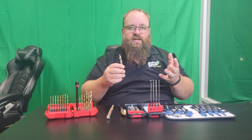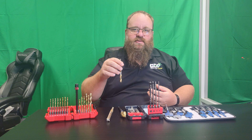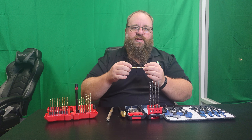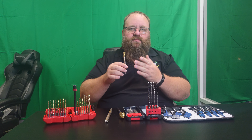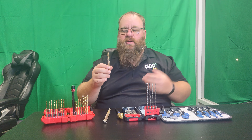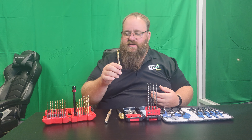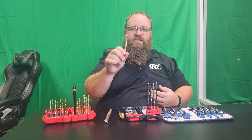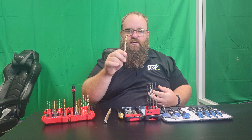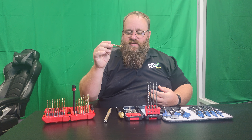I always recommend getting them in the quarter-inch shank so they don't spin on you. You can go up into cobalt if you're doing a lot of heavy metal drilling. Cobalt is really nice, but I break a lot of those because using hand drills — it's so brittle, it's such a tough steel that I'll snap them a lot. So I don't recommend using cobalt for everyday use at work. The gold-looking titanium nitride coated bits — everybody makes them: Milwaukee, DeWalt, all those guys. But again, these are not for concrete. Please do not put them in concrete. They're for wood and metal-type purposes, drilling through panels, things like that.